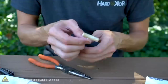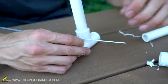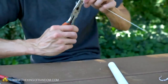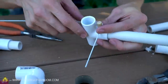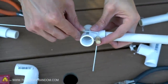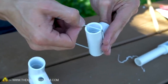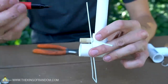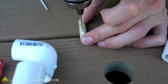The hanger fits into the drilled hole and it's loose enough that it can spin a little bit, but there's not a lot of play — that's just what we want. Leaving about three inches of wire on one side, we now want to bend the piece of hanger so it goes down below our PVC pipe, extends underneath by a couple of inches, and then comes back up on the other side. We want nice square angles that fit perfectly flush up against the sides of the PVC. Measuring on another piece of PVC can help you get a really accurate squared-up measurement. Then we bend the wire back through the dowel just a couple of millimeters away from the first wire, which means we need to drill a second hole.